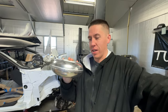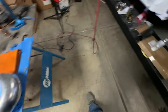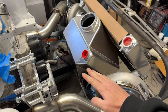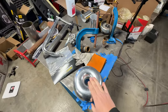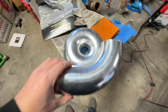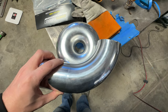We're going to try to take this thing, cut it up, maybe turn it into a couple quarters, use a 90, and see if I can make this little gap right here work out okay. That needs to come down a little bit and then in a little bit, but I'm kind of letting that side dictate based on this, and hopefully this allows us to get there. This being an aluminum donut, this is about as tight as you can get for a 3-inch radius, because this will show you right here how tight it would be if it wasn't. That little radius there is almost that much of a difference.